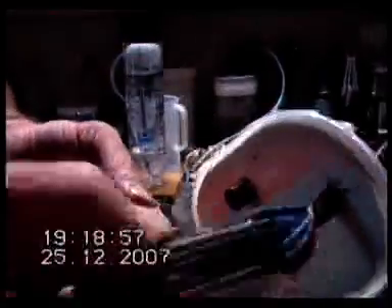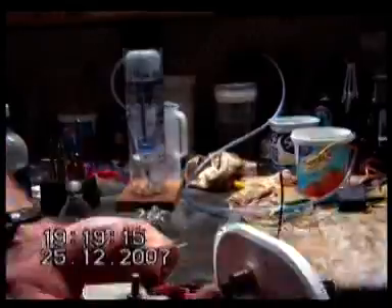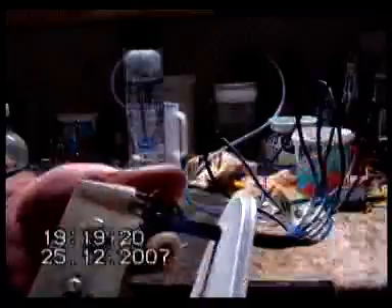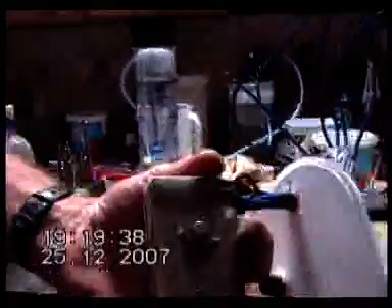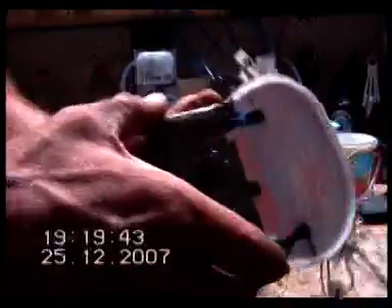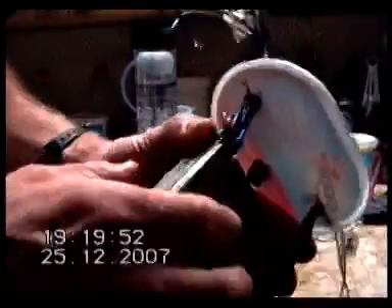This is my new cell I'm working on now. On there you can see the bits of plastic that are spread out under the washer, and the same on the other side — so that works really well for an insulated bolt. I've also got my milk bottle insulator on there, and I've bent pieces of milk bottle that I've cut out, doubled them over, and put them between my plates on the outside. So that's insulated all the outside plates on both sides. Up inside there in the top where they may touch, I've also inserted some in there. I've tested it all with a multimeter — nothing's shorting out. So I've got our insulated bolts, the milk bottle pieces between every plate where the bolts go. It's only the thickness of the milk bottle, which is fairly thin, but that works well.